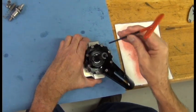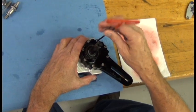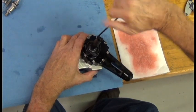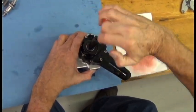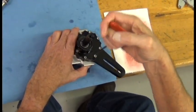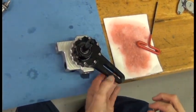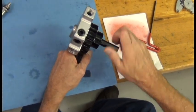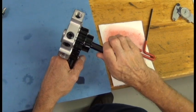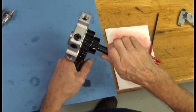The first time you grab the shaft and it doesn't turn right, by doing it two or three at a time you will determine that the previous position was rough. This one feels better, and you've got to repeat that until you get the pump where it turns nice and smooth and doesn't have a tight-loose-tight-loose spot. Failing to do that can damage the pump because the clearance in these pumps is very tight, and you can run the hard coat out of the body by assembling a pump that's not correct.